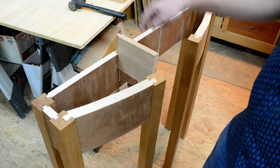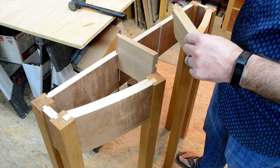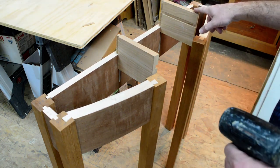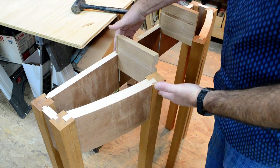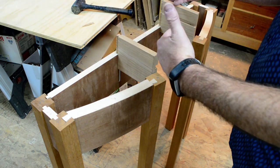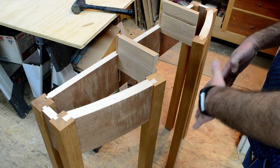I have these pieces — sliding dovetail on the back; I've got left and right. This piece chipped out on me when I was removing it. I'm going to hang on to that piece and glue it right back in — it'll be as good as new. The wood has swelled a little bit since I fit these things; it was a little more seamless to get in there. When these are closed, both legs are the same distance from back to front so that the curve will look continuous when the top goes on. If one were longer or shorter, you'd get into real trouble with aesthetics and structure — your eye picks up on that right away.